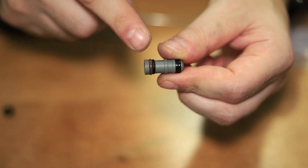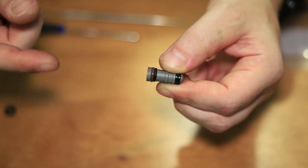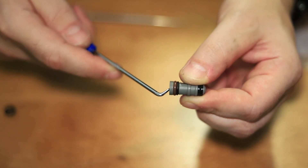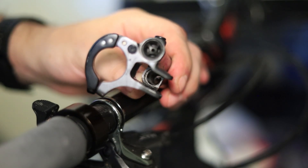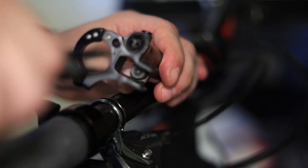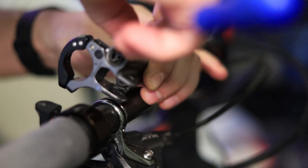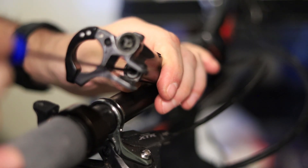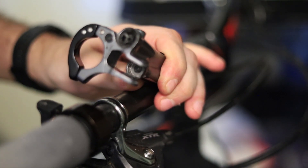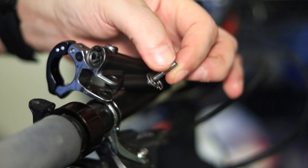Note: if you put this in with an O-ring that's a little too big and too tight, and the spring doesn't have enough force to push it back out, the only way to get it out is with a pick — push it into the wall and dig into the plastic to pull it out. Make sure it's all clean in there. Now we're going to put our piston back in. When pushing it back in, take the top bleed bolt off first — that makes it easier. Once fully seated, it'll be easier to get the C-clip back on.